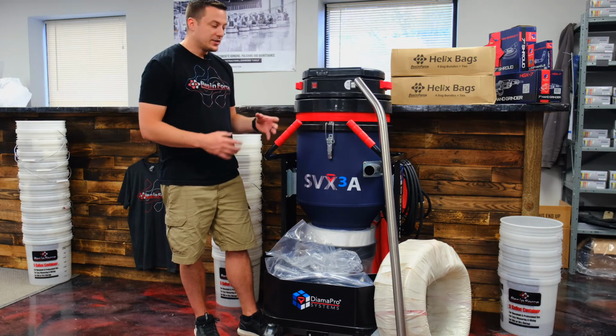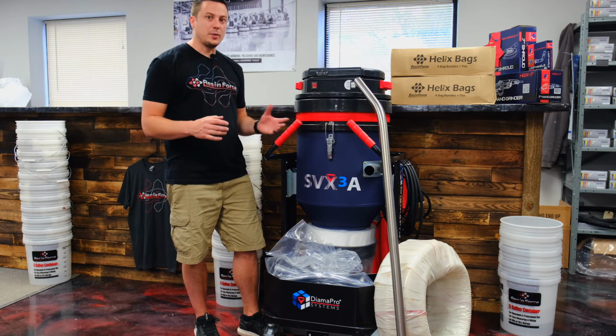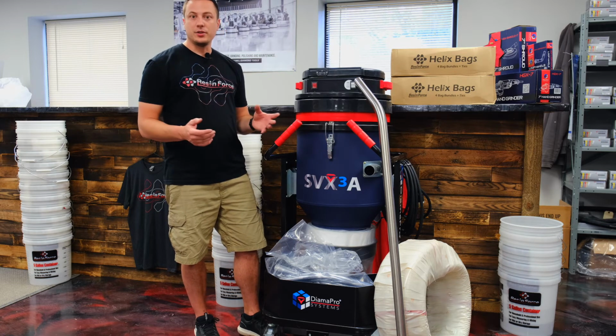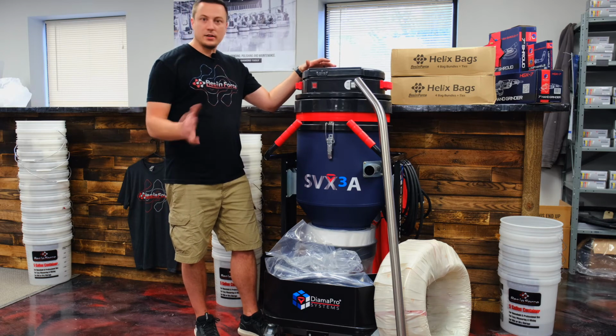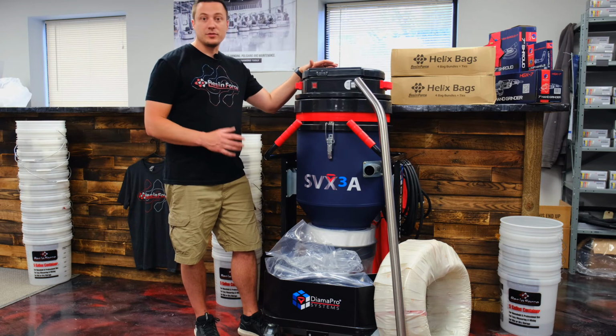285 is great suction for most grinders, up to 25 to 30 inches in diameter, based on how much production and how much dust they're going to create. Anything bigger than a 30 or a 32 or a 38, you're going to want something bigger. But this is great for hand grinders, small grinders, medium-sized grinders, propane, electric, whatever you need. This is pretty much the workhorse vacuum. It's the most of what we sell.